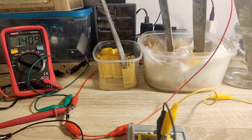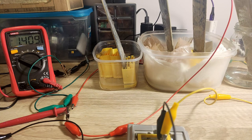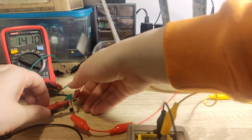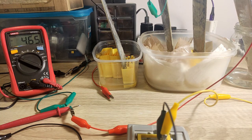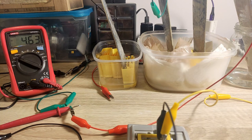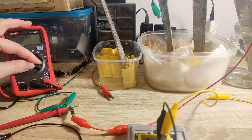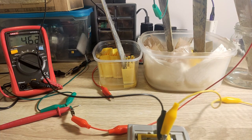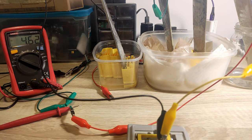Alright, as far as I can tell, all of the cells are charged. So here goes a Hail Mary, really. So the voltage is perhaps a little bit high for the Game Boy. I mean, anything below 5 volts should be fine, and you shut up. Plus, the voltage will go down incredibly quickly after load is applied.